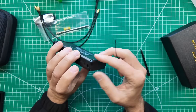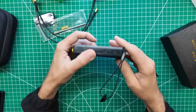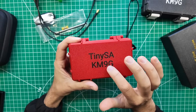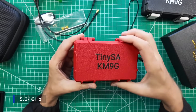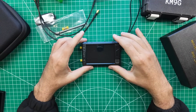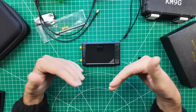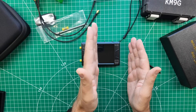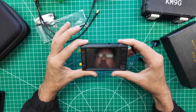I actually like to have the stylus because the more you touch the screen on the TinySA, the dirtier she gets. So this does everything that the TinySA Ultra does, except it goes to 7.3 gigahertz. The TinySA Ultra does everything that the regular TinySA does except it goes to a higher gigahertz frequency. The problem with the regular TinySA was that if you were testing harmonics on, say, the two meter band, the harmonic was actually out of range of the low port — you had to do all your work on the low port, get one sweep, then do a second sweep of the 144 megahertz range, and you wouldn't see the first harmonic but you'd see the third, fourth, and fifth. So you had to composite those two charts together, which was a pain. This one goes even higher for you gigahertz folks.